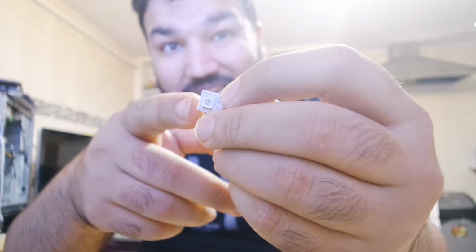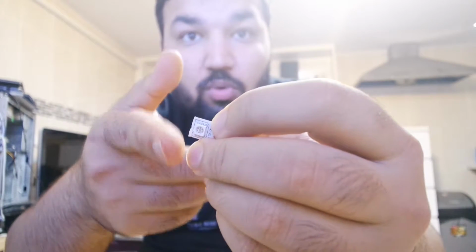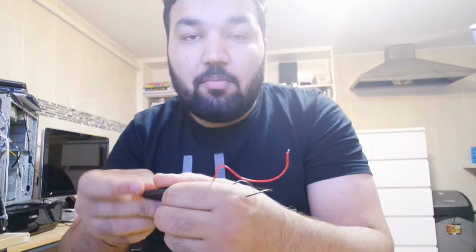Well guys, my last option, as you guys saw, was the SMD, and basically this SMD chip is very good. It has all the colors that I need. I can either switch to green, basically I can switch, or I can choose one color out of these three colors that are on one chip. That's this small chip, and it's going to be embedded in here in this spot, and the wire is going to go directly to this battery bank. It's not a battery, it's like a bank of 3V batteries. CR2032, I think it's 32, yes, CR2032 battery, and two of them, providing 6 volts. And this SMD chip is the best one I can find and works much better from all viewing directions.